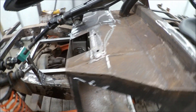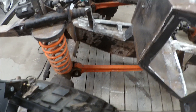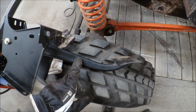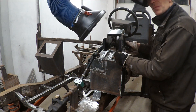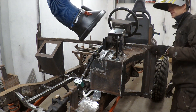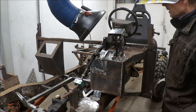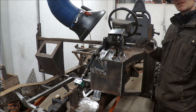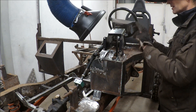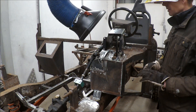So I need to maybe rebuild this box anyway because I can't get that stroke. I also think I will extend this pedal so I don't need any servo. Now I'm just tacking the brake pedal in position to see if I can get a comfortable driving position with the feet and everything. It's very hard to decide where to put it, so I just tack it and then make the proper brackets and all that stuff.